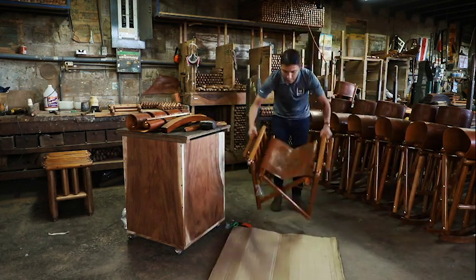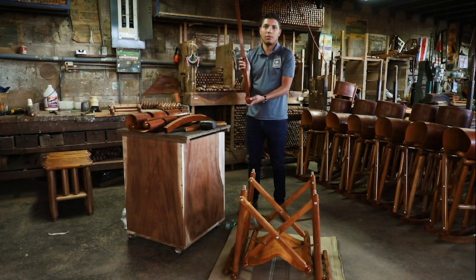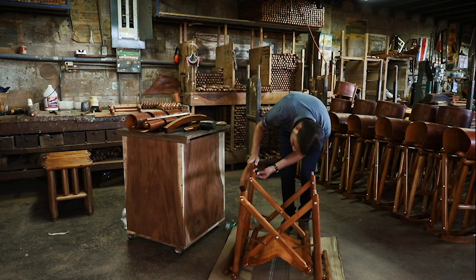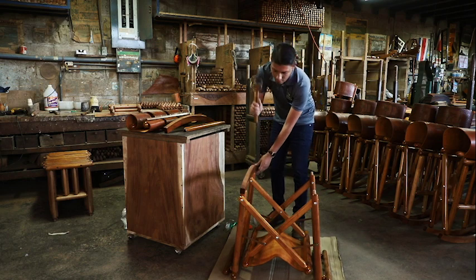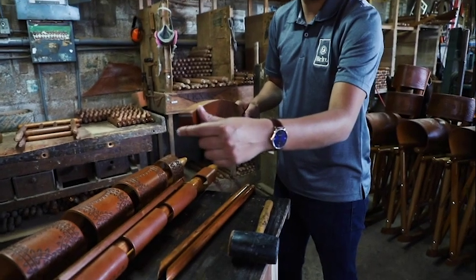Step 6. Place the chair base upside down. Match the front two holes in the rocker with the flat end to the front, to the legs of the chair base. Attach the rocker. Firmly tap the rocker into place with the rubber mallet. Repeat with the other rocker.